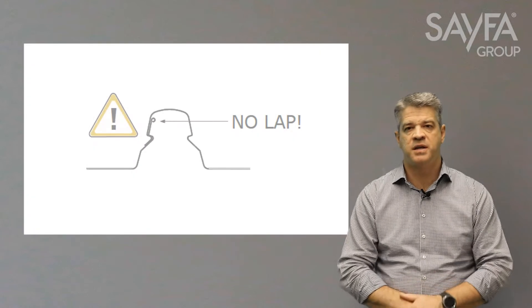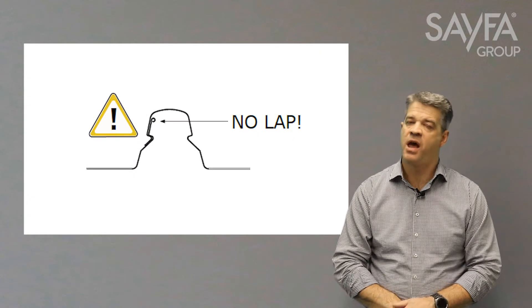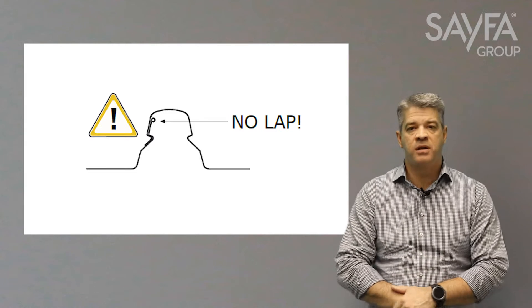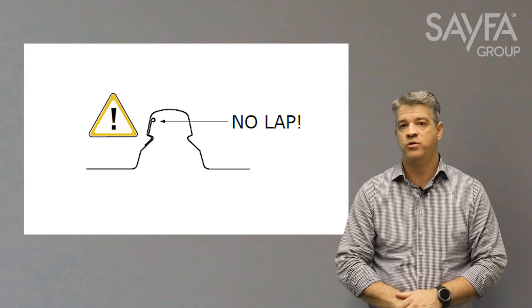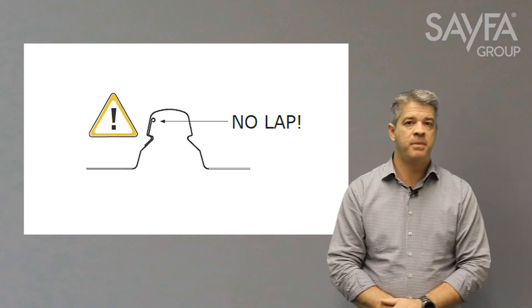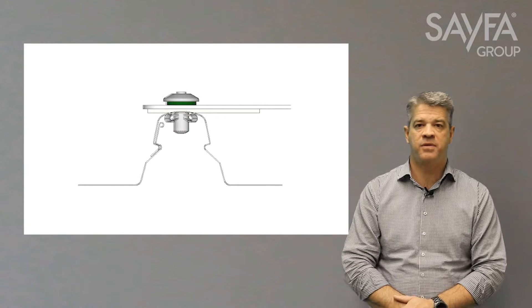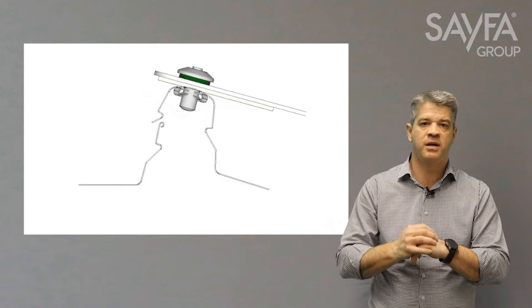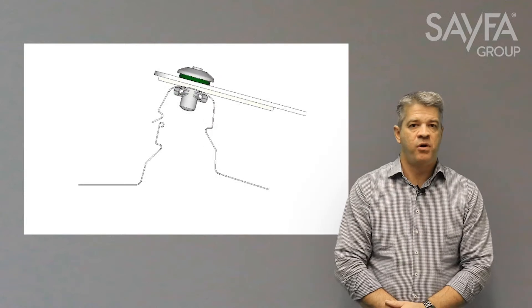The other point to note is that some clip-fixed roof sheets do not have a full lap, so where the anchor is riveted is critical. The rivet may not have gone through two thicknesses of roof sheet. If it is riveted on the lap, depending on the way it is fixed, putting that anchor under tension could cause the roof sheet to unclip or delaminate. It's very important to understand this when installing an anchor.